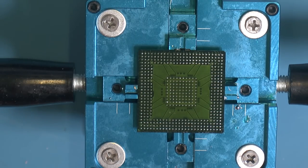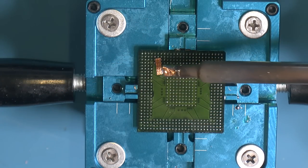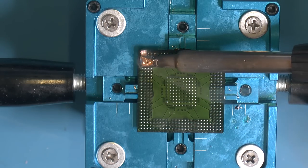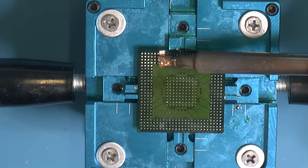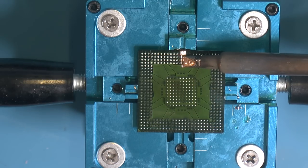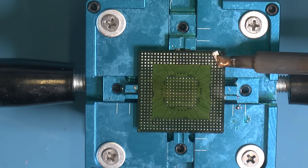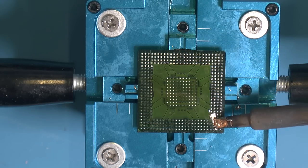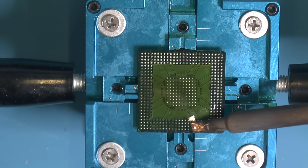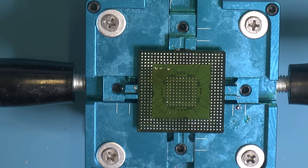Next is removing all the solder. Funny how the pad looks bigger when you're removing the very small solder balls that are always created when you're putting solder on them. I think this particular wick is actually getting kind of full of solder, so another one.